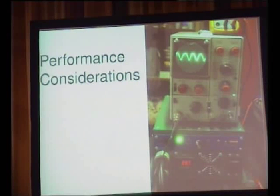So this is my battery charger. It's taking 10 amps out of the mains and putting 40 amps into the battery. It's only a little battery. And that is the voltage on the oscilloscope — it's going up and down. The charger puts in big pulses of current. If you try to measure that at a random position, you get a massive swag of noise. You need a way to get rid of that, which also lets you read the voltage quickly. You have to wait for several of those cycles to know what the average value is.